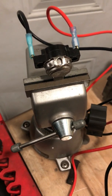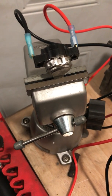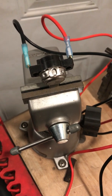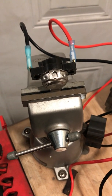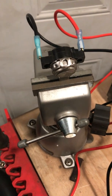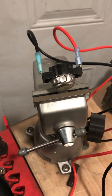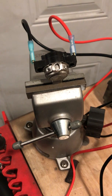The way this works, of course, is when the stove gets hot the switch closes and turns on the convection blower, and acts as a proof of fire — which when the stove goes into run mode it senses the heat from the fire and keeps the power going to the auger motor. If there was no heat sensed, then of course it would not turn on the convection blower and it would stop power going to the auger motor and the stove would safely shut down.